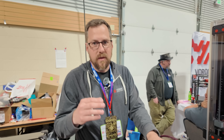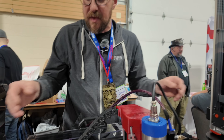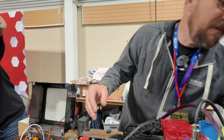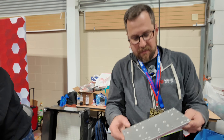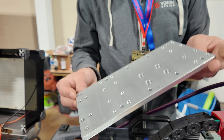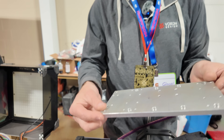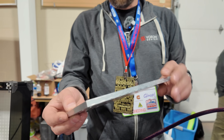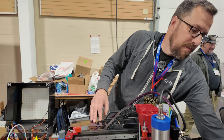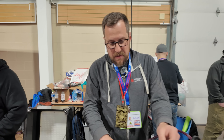A lot of the parts can almost be done by hand. The most complicated part is the X carriage, but ultimately it's just a bunch of holes, counterbores, and four threaded holes. If you had a good drill press and were good at laying it out, you could do it by hand — it takes a lot of patience but it is possible. You could theoretically bootstrap some parts out of plastic, print them, and replace them with machined parts once the machine is online.